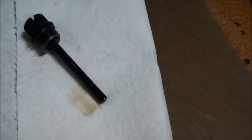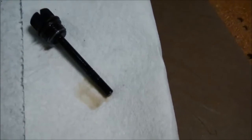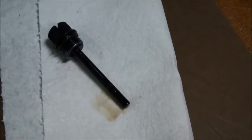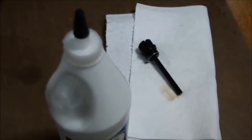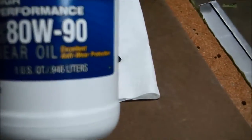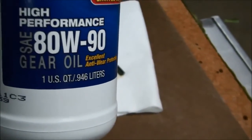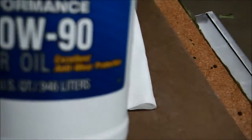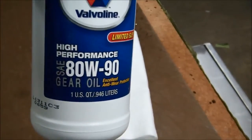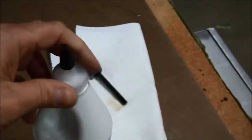We were right at the proper level today. The next thing we're going to do is take out the drain plug, drain all of the gear lube out, and show you how to make a complete gear lube change. You will need to prepare by getting yourself 2 quarts — it takes about a quart and three quarters, or 1.8 liters, so you will need basically 2 quarts of 80W90 gear lube to make this change.